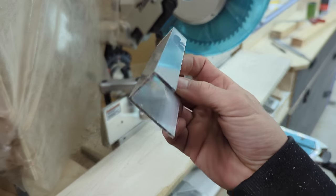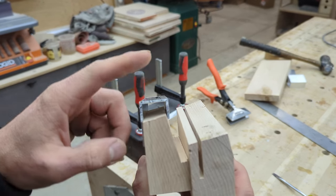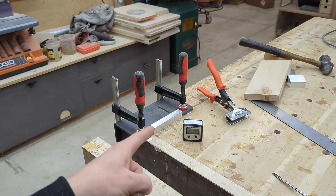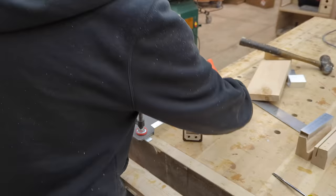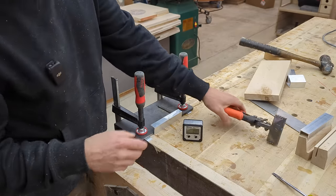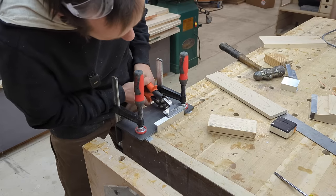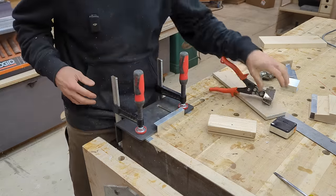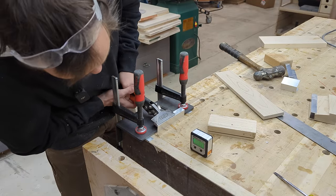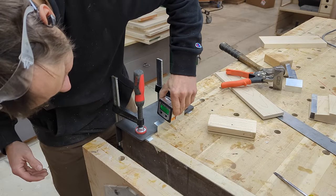Now it's time for the bending — this part turned out a little trickier than I expected. I tried cutting jigs I could hammer the bracket over, but I had trouble getting that to be consistent, so I moved on to the more crude method: using a sheet metal tool and slowly prying it up until the angle reads between 10 and 12 degrees. I tried to be pretty careful not to over-bend the aluminum. Aluminum tends to fatigue pretty quickly and becomes quite brittle if you try to bend it back, so you only get to bend it once if you want to keep it strong.